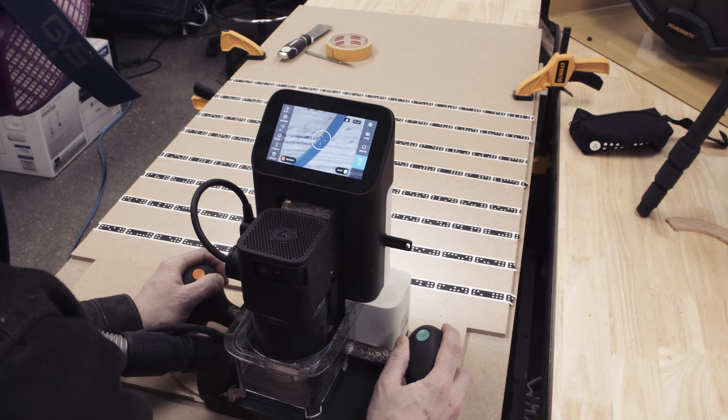I'll go through the same process with the Skyrim logo, but I'll also do a run with a 1/16 inch bit before the 1/32 inch. This shape has a lot of acute corners and using the 1/16 inch bit keeps me from having to hog away extra material with the 1/32 inch bit.